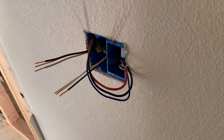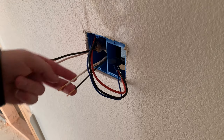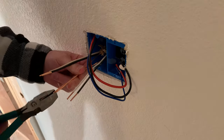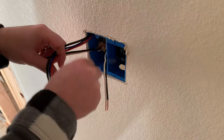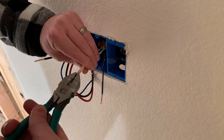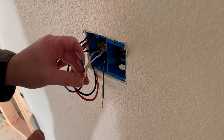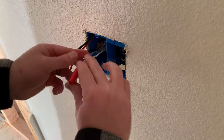This is what you should be seeing: your relay wires coming into the line voltage side of the box, wires that come from the electrical panel, and wires that go into the heater. Potentially you could have another branch or two if you've got additional wires going out of this box. Once you've got your different power lines identified, you can start connecting them. Connect all the grounds — the bare copper wires — and push those to the back of the box. Then do the same for the white wires. This is your common line, and here you want to take the blue wire from the relay and connect it with the white wires to provide power to your smart thermostat. Connect any other white wires in this box to this common connection as well.